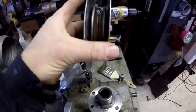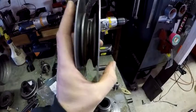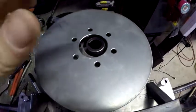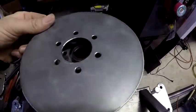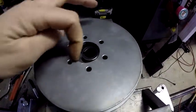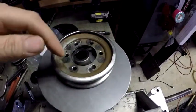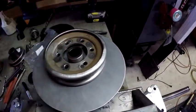So I made these. Just like that. Now my pulley is sandwiched between two flat pieces of metal, and that's going to be my new belt keeper. That's what I want to do to my engine. One of the only issues I'm running into is there's an open space between the back side of this belt keeper and the top side of this flat flange. So I need to make spacers to fit in here, so when I tighten the bolts, it's not compressing this in. I want something so when this is tight, it's putting pressure on the pulley which is sitting on that first flange on this coupler system.